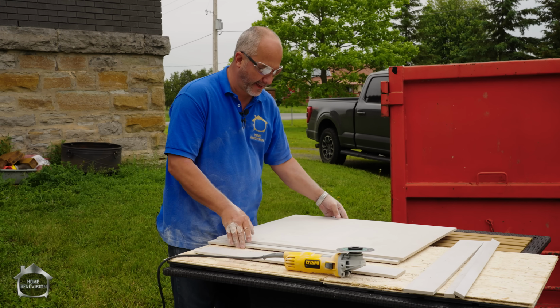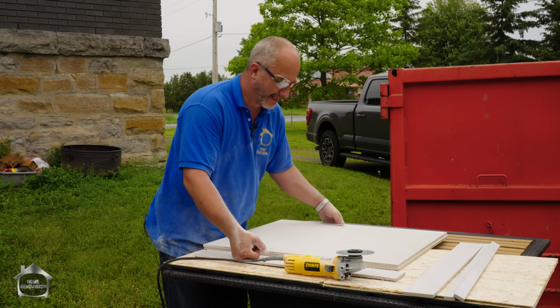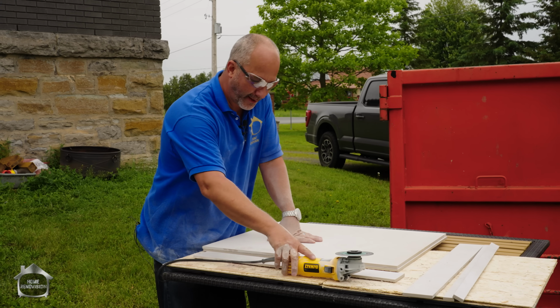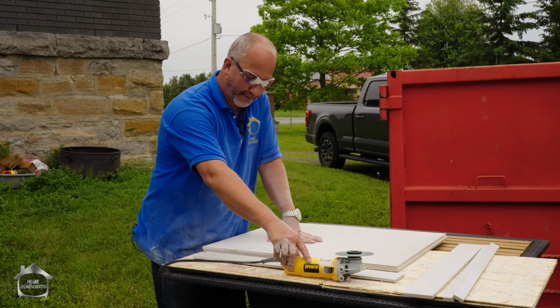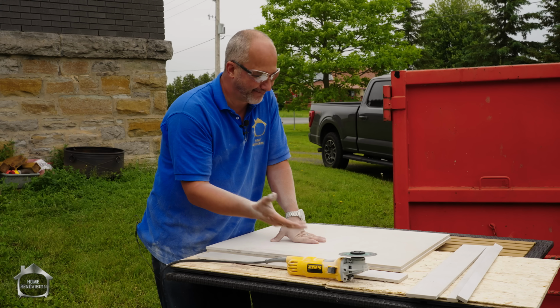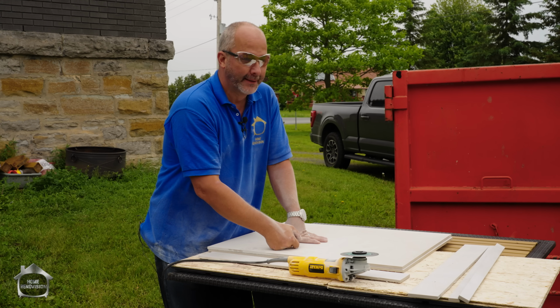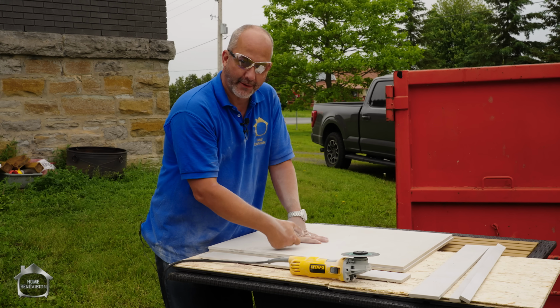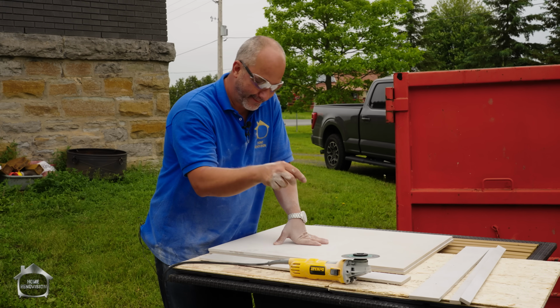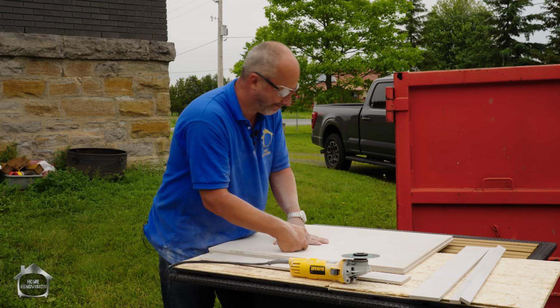Now I know that takes a few minutes, but now I've got 4 of the 8 cuts that I have to make for the whole countertop. I think it's worth it. Invest in a grinder and a blade because this is a tool you can use over and over and over again, where if you're gonna buy a scratch tool to do this, you run the risk of it not breaking nice and needing to go back to the store for more tile, or you're gonna need to buy a $2,000 wet saw, right? Keep it simple and just take an extra few minutes to get the job done perfect every time.